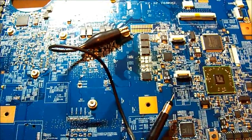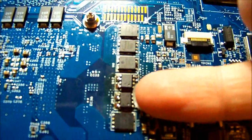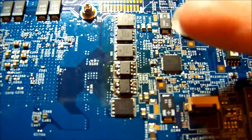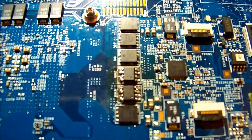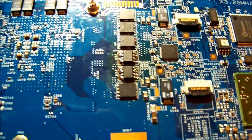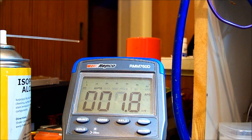I've found off the other laptop a couple of FETs that will pretty much do the same job - they don't have the same thermal capacity as the rated ones, but this is just a temporary test to see if the board works. We'll flip it over, put the multimeter on. We're looking for anything around a volt or so, anything to suggest this is actually working. Let's hit the power button - three, two, one - on and we've got...